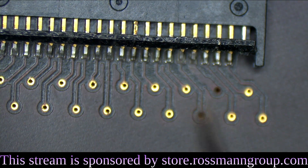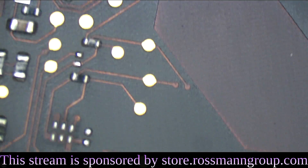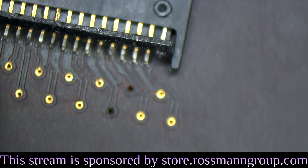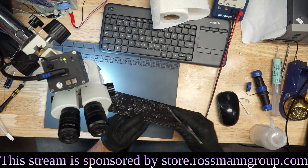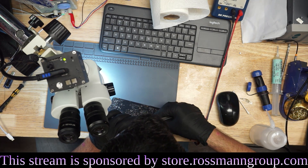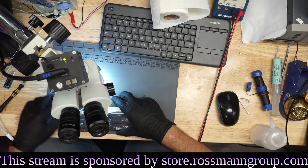The way this works is that the keyboard connector is going to be talking to stuff on the other side of the board. So it's going to make its way through these holes, and I'm going to try to put this through the hole. We're going to be taking this little wire — I think it's a 48 or 46 gauge wire — and I'm going to try to get it through the hole, just like threading a needle. There we go, and it goes through, and we pull it through on the other side of the board. Beautiful.